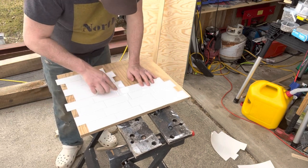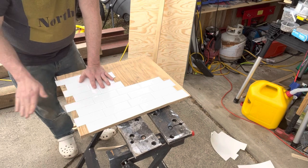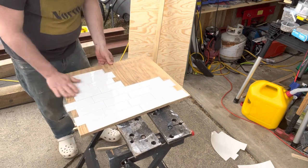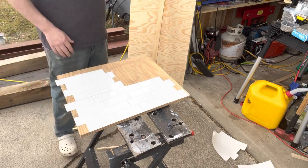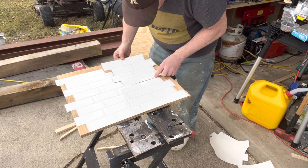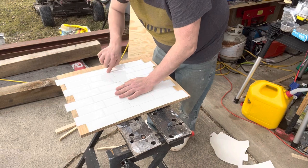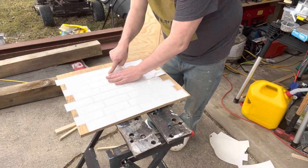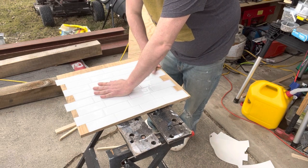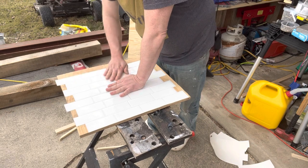I did get that to overlap right there, even though it doesn't say to overlap there — which can confuse you because it depends on what piece you're doing. But you want to overlap your height too, that way your grout lines are uniformly the same thickness. It's square, so line up with your last line. Take your grout all the way down to the previous tile, and then you've got a pretty dang good seamless application. From a couple feet away, it's actually pretty challenging to tell this isn't real tile.